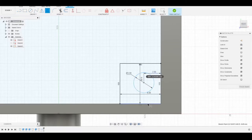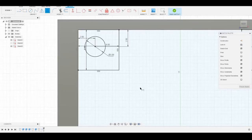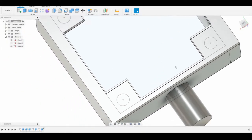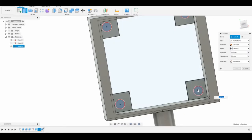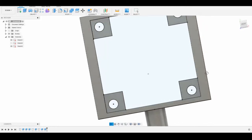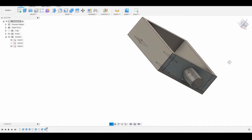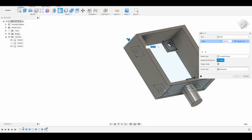You can see it doesn't fit centered to the box, but it should sit centered to the actual thing — we just have this little overlay. We can shrink it in as we see fit to give the screw more to hold on to. I think this should work. If we go on this side and enable the sketch, you can select these holes and go on the side view, grab the arrow, pull it through — it's already on cut — and it'll cut right through. We now have holes in there for the screws.